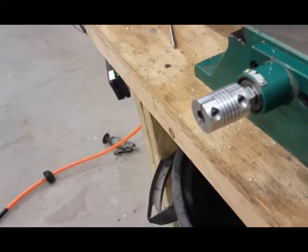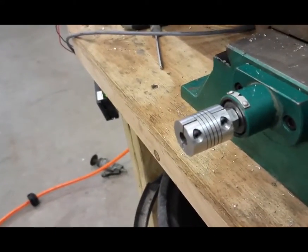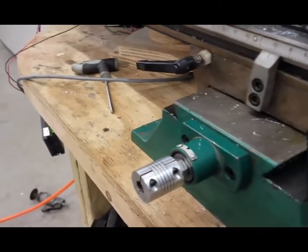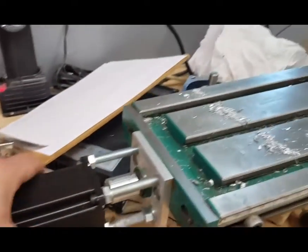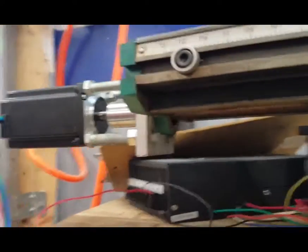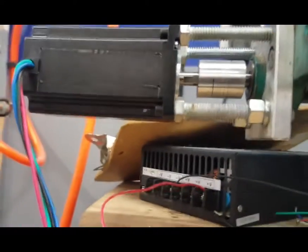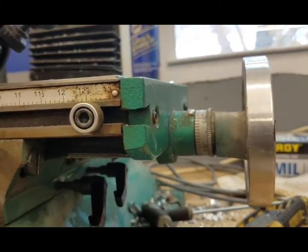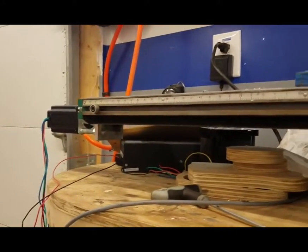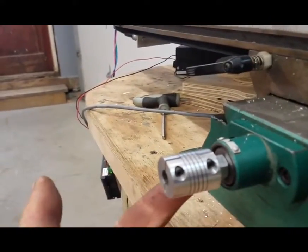This axis is a little bit trickier because the thrust bearing that keeps the lead screw from pulling in or pushing out — the thrust bearings are in this portion right here. When I did my x-axis I chose to mount things on the end where there's no thrust washers, just a bearing. All the thrust washers are in the other end, so I left that end stock and put my motor on that end so thrust wasn't an issue with the x-axis.